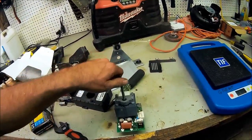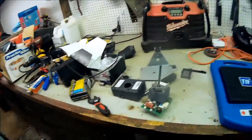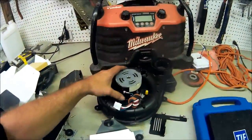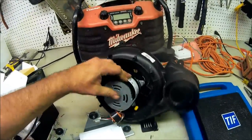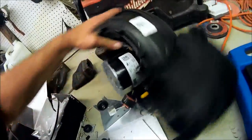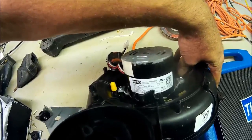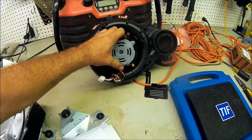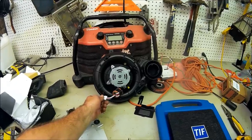I just wanted to tear this down — I thought it was interesting with all this weight on here and how heavy the motor actually is. Basically, on the new ones, they don't make this motor anymore. What they did is change it to one of these little cheap AC motors with a circuit board. This new one is 120 volts, 110 watts. There's a motor choke there. I'm not sure yet whether they're controlled by AC or DC voltage — probably DC.